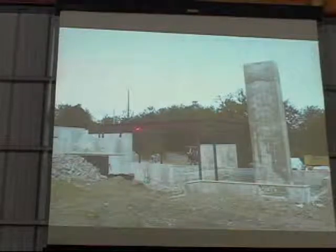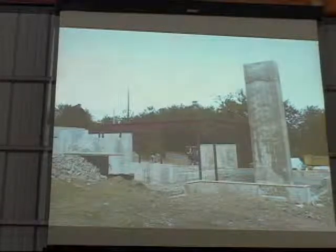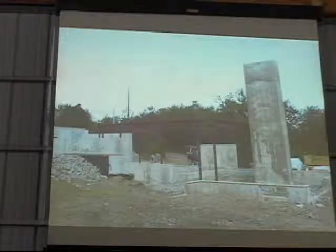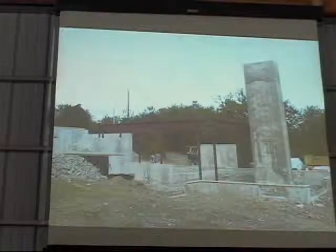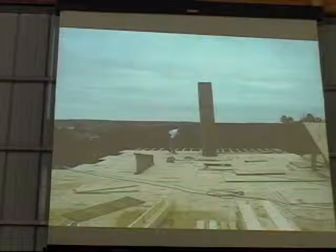The main point is the pier foundation is completely separate from the house foundation. There's structural steel supports for the house, but they do not touch the pier. The builders kept asking why they couldn't attach anything to it. So you just fill the cracks with RTV so there's no chimney effect, but it's completely separate. Every once in a while they put a support too close, and I'd have to say take that one out and cut it — they thought I was totally insane.